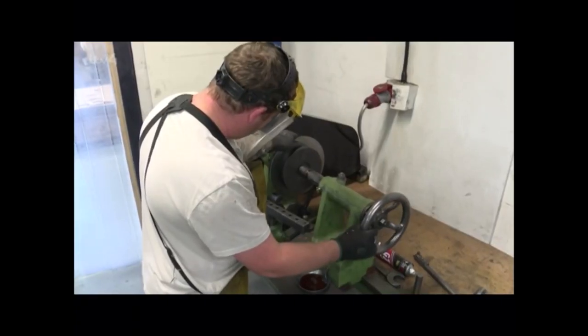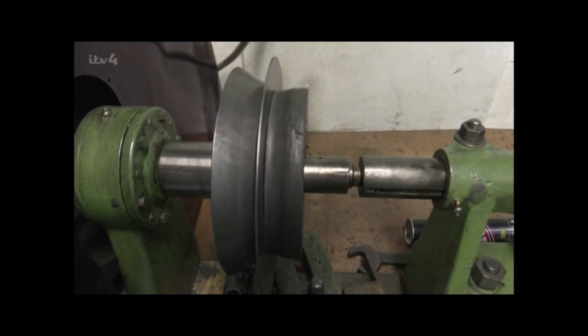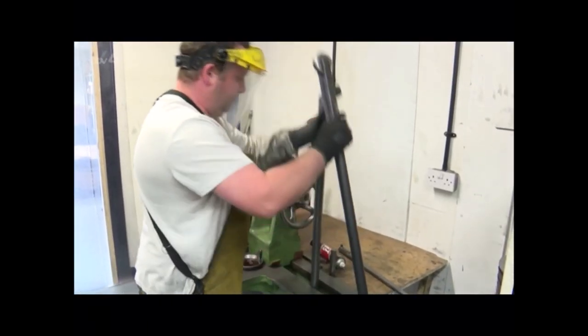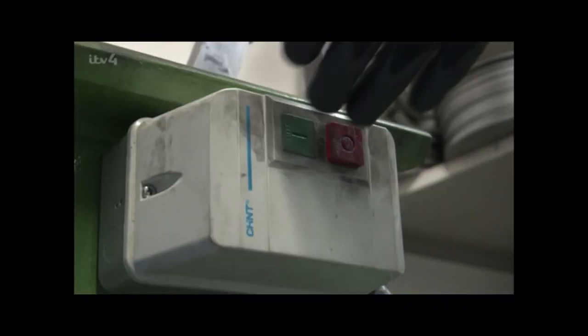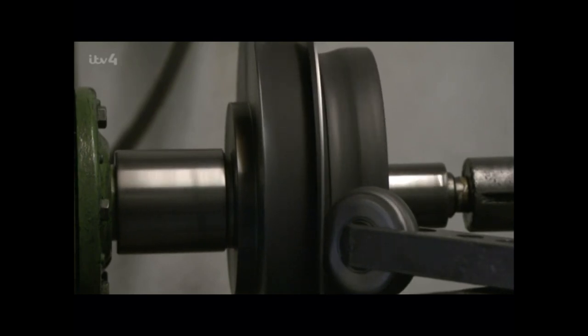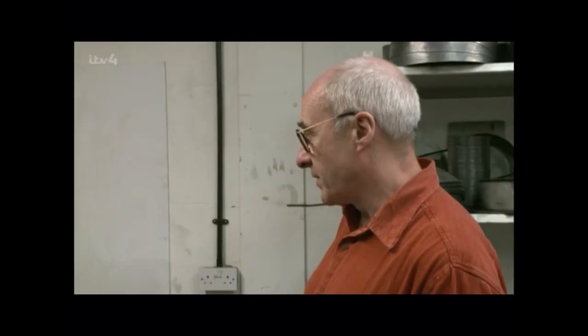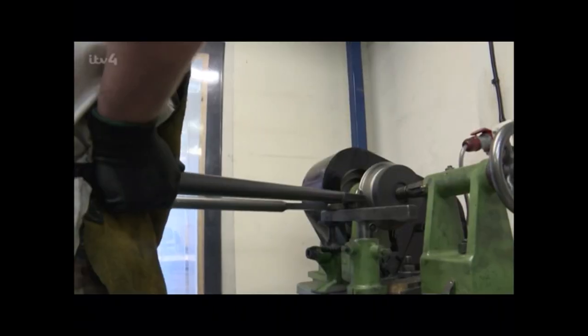Carl clamps the disc into the centre of the lathe, next to a wooden template that matches the finished shape of the pan. A former bar, made of hardened steel, is then levered onto the edge of the spinning disc. The force of the bar pushes the steel around the mould, forming the shape of the pan. The whole spinning will take around 2-3 minutes, depending on how big the pan is — a bigger pan takes quite a bit longer, and a thicker pan takes a lot more effort to move the material.